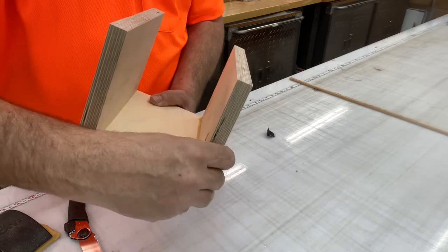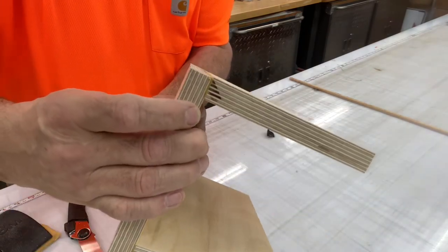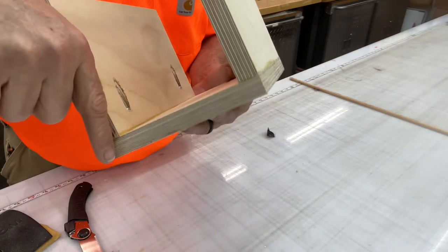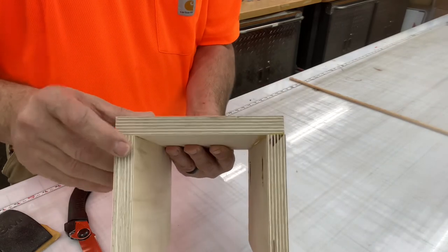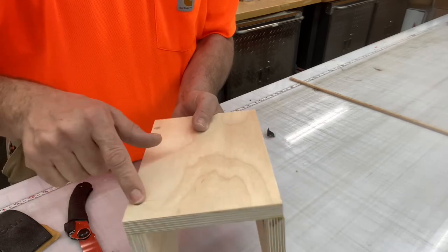The pocket hole is a good method — I just don't like the look, though you can dowel it in too. But one of the big drawbacks for me is the movement of the board as you're screwing it in, because you're screwing at an angle — about 10 to 15 degrees — and that angle causes board movement as you're tightening it up. Whereas when you do a flush mount screw going straight into the board, the only draw is towards the board itself, not left or right. That was just a short video to show how I typically do butt joints. I appreciate you watching — please like and subscribe. This is Dave the Sign Guy signing off. Thank you.